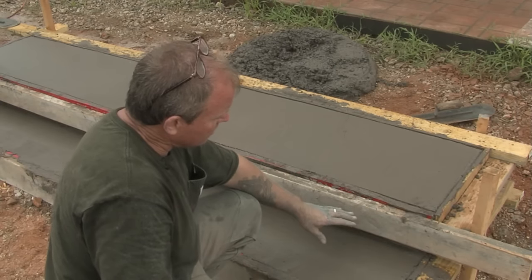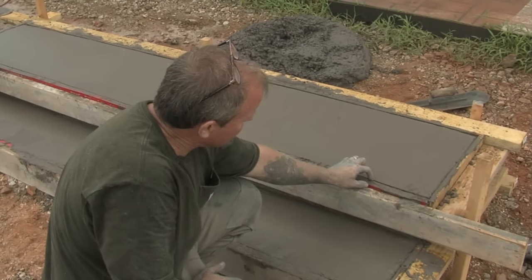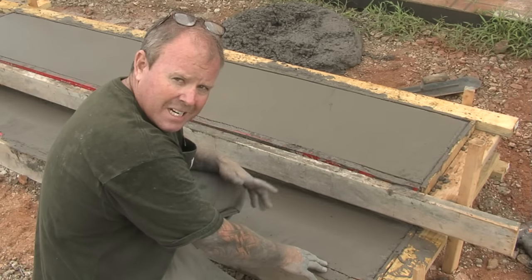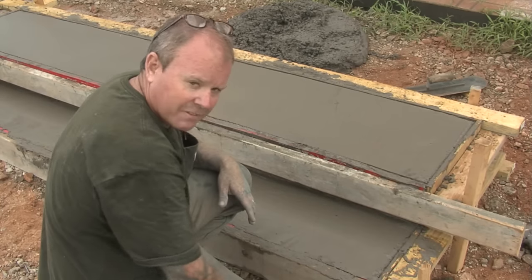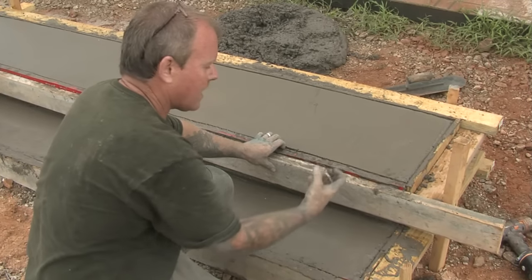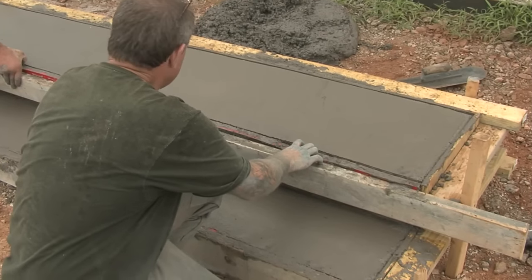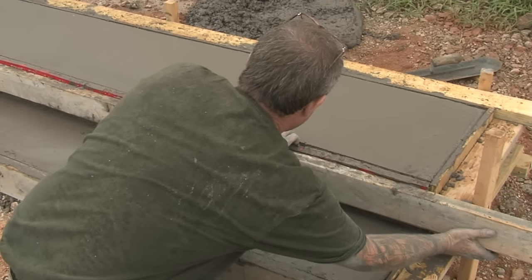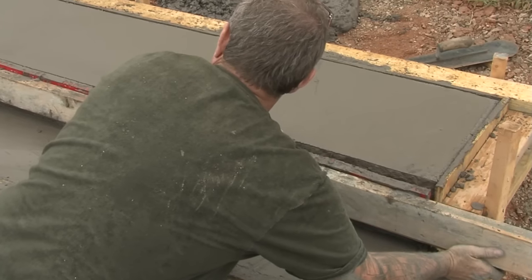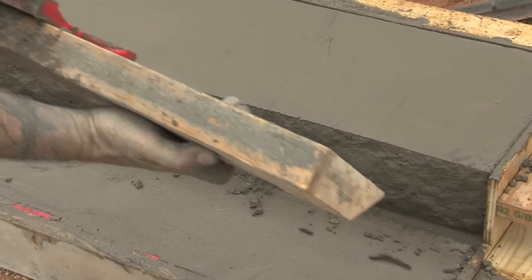Back over here on our step liner, I like to go ahead and remove this. What we need to do is float underneath the step liner because of the width — there's going to be a little indentation or void. On our bottom step liner there's really no need to strip it, because this is going to either receive landscaping or your sidewalk. But over here what we like to do is break the bond. You don't want to just pull it real quick because you could actually pull a chunk off. So just slowly go through, pull back gently, and then break the bond. And we've got that beautiful stone-like rock edge that looks really, really nice.